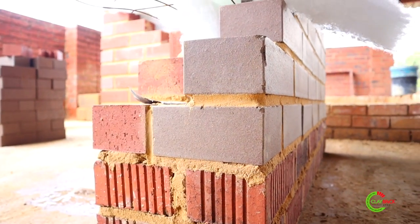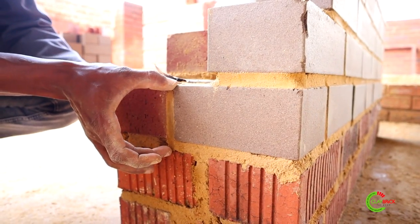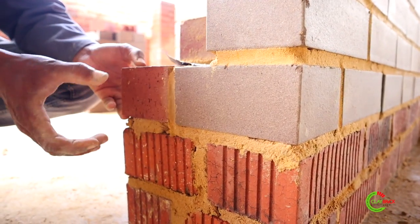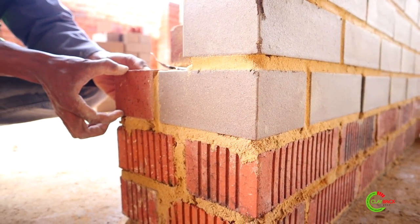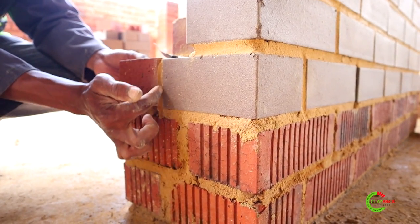Your cavity wall is 280 millimeters thick in total. You have your brick-and-mortar bed here at 160 millimeters, then you have your 110 millimeter brick which is a half-brick wall, and then you have a 10 millimeter perpend joint.